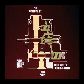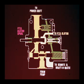The PTO clutch spool is located in the flow divider and PTO valve body in a position to supply oil to the PTO clutch from the transmission supply gallery. When the spool is positioned as shown, the PTO clutch is spring released. Moving the spool into the valve body directs oil from the transmission supply gallery to the PTO clutch. The pressure level on the oil directed to the clutch is below that in the transmission circuit due to the low relief value of the clutch modulation valve.